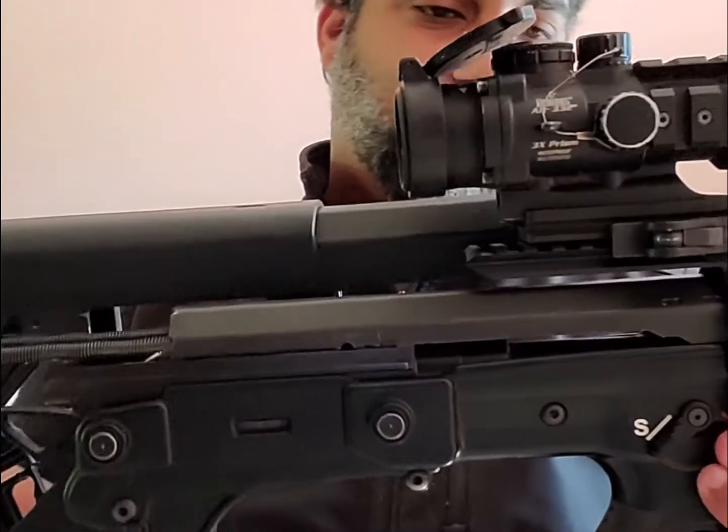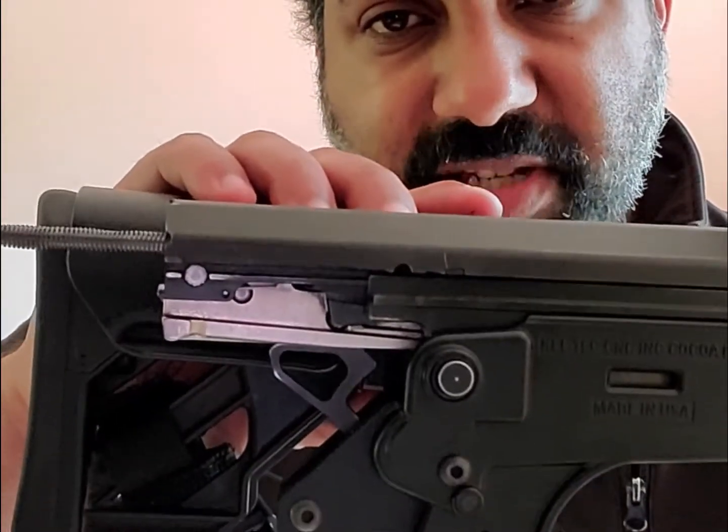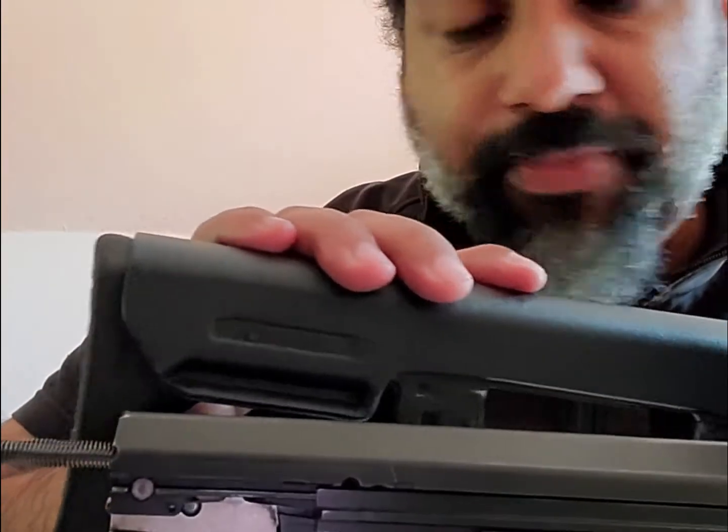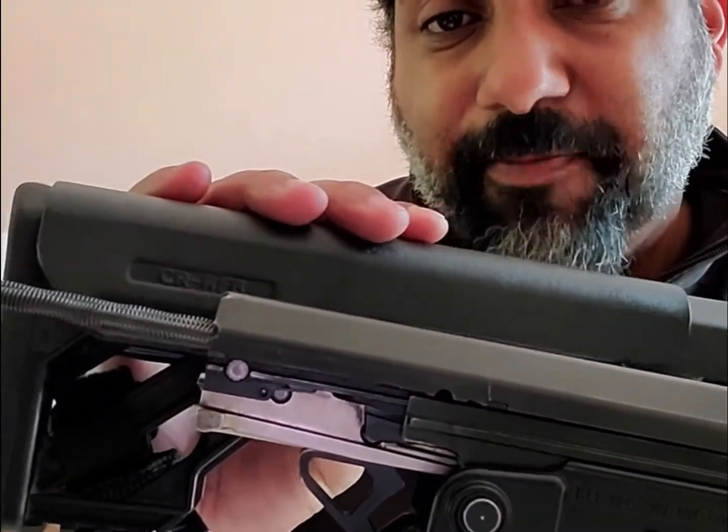To give you an idea, here's the bolt as it meets the barrel — the barrel starts right about there. As this gun is cycling, this is about where the top dust cover is. This is how much room you have with the bolt all the way forward, and when you move it to the rear, this is the total amount of travel this bolt has. So if you have too much gas, you're just causing the bolt to beat against the back end of the buttstock. And if you run it over-gassed enough, this whole section can actually break the welds on the butt pad. This is why this gun has to be adjusted for most of the ammunition you're running.